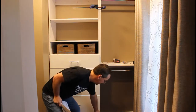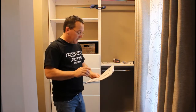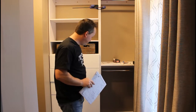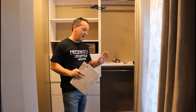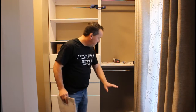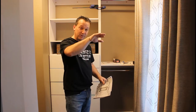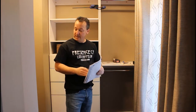As for the bases — they're like extensions for the tower units. I suggest you put them on first before installation. I waited because I wasn't sure I wanted them on there, but the great thing is the back of the extension has a three-quarter inch notch designed to go over your existing baseboard trim, so you don't need to take your baseboard off.